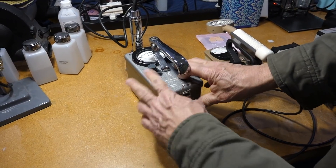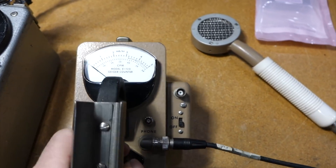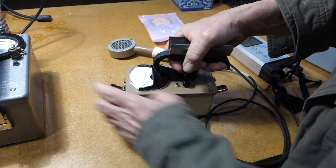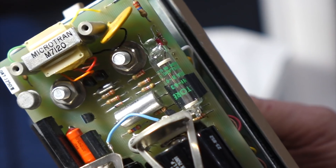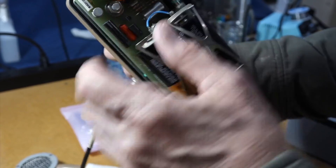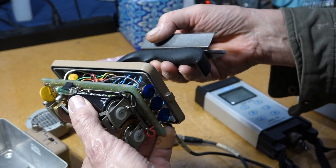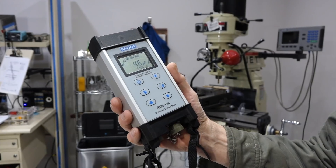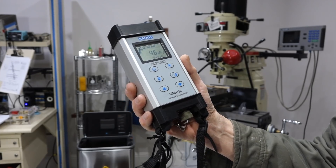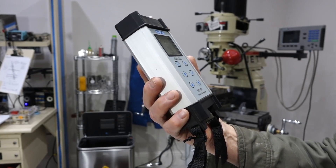Then this is a similar thing, just upgraded — maybe early 70s. I like this one. It's got a little pencil vacuum tube but also an old transistor, a little more modern transistors, and a very early late-60s vintage IC. So it's the next generation. This one's got a Geiger counter tube and a scintillation system — a plastic scintillator tube and a photo multiplier. So it's got a very wide range, five micro-rem per hour to a thousand rem per hour.